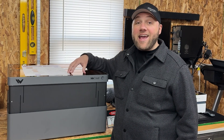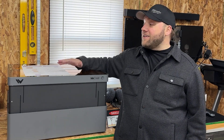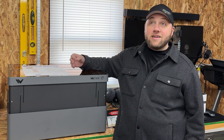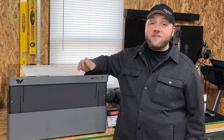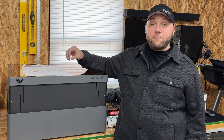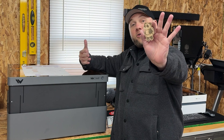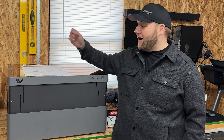They also said you can do 18 millimeter hardwood in one pass — harder wood versus soft basswood, for example. On top of all that, they kept the engraving as clean as possible. Normal laser engravers have about a 0.2 millimeter engraving area, but this one gets down to 0.08 by 0.08 millimeters, so you can do really detailed engravings. I was skeptical myself, but I did a test run and cut this harder material out in one pass. I think I used seven power and it popped out phenomenally — super clean.